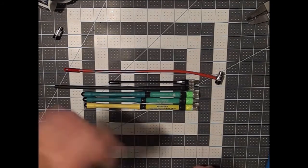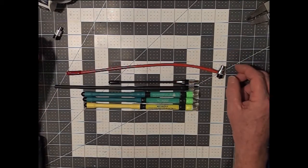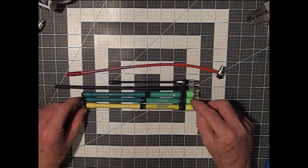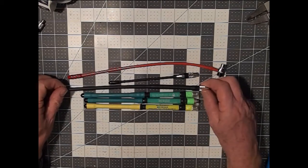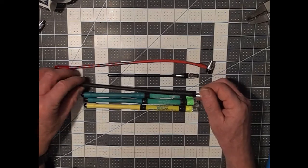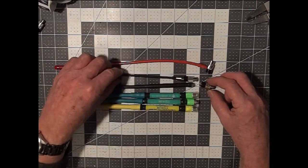In the previous video we went over the pros and cons about counterpoise or rat tails as they're commonly referred to. In this video we're going to hone in and be specific about how to modify an IPX6 antenna which is based upon the Smiley 5.8 SAR rubber duck, so that it will accommodate the counterpoise or rat tail. As you can see in its stock form, the Smiley 5.8 has a removable base on it which is part of the Smiley base system, which allows you to move the bases between their different antennas.